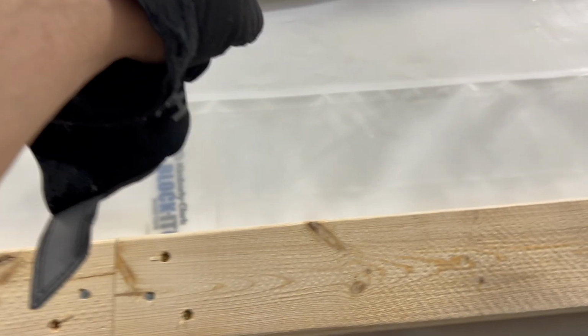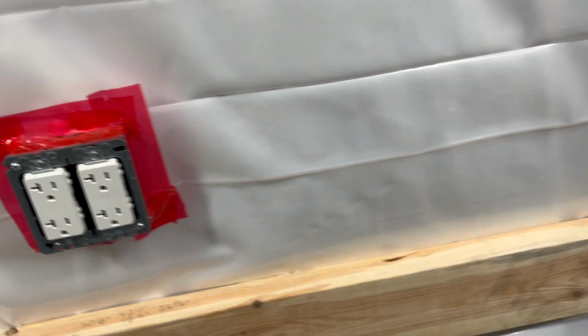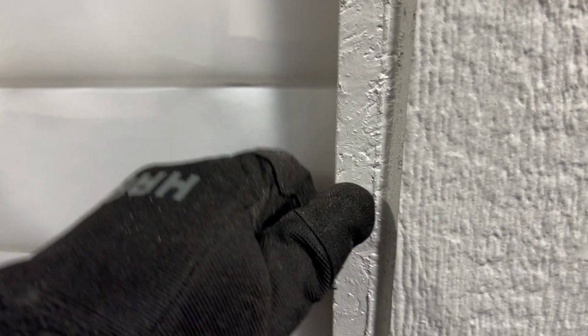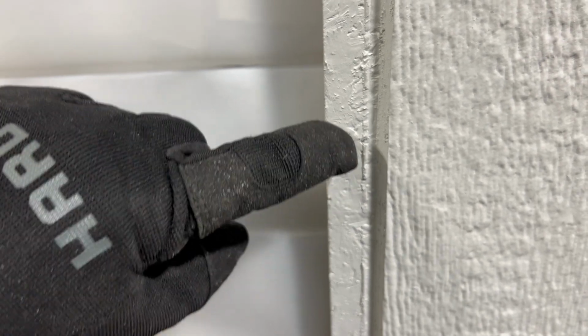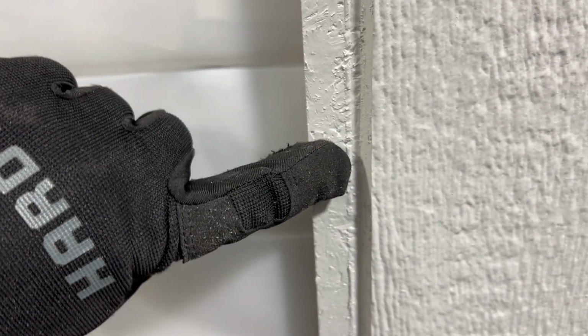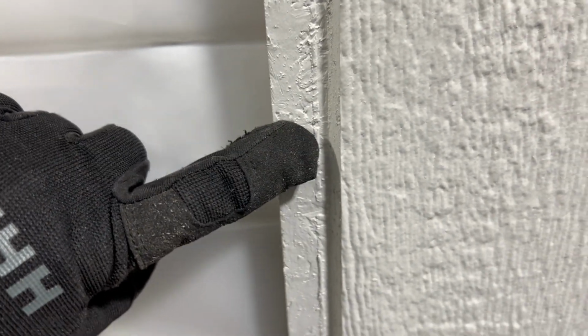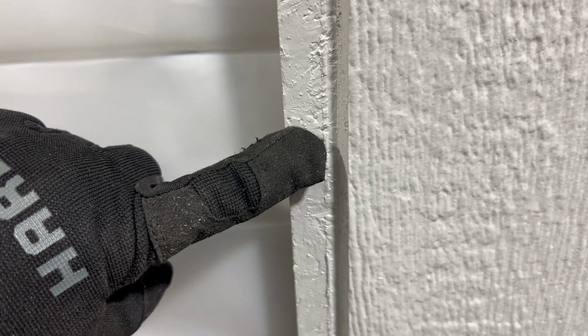It is the total from the very top down minus that 1/4 inch, but it's to the bottom of the box. And then the third measurement I take, if you look at these sheets here, see there's a little nub right there. That's the overlap, and that's where you're supposed to stop that tongue, or that overlap has to come up right to the beginning of that groove. You don't want it over that groove. You want it right to that groove, and that's what they recommend.